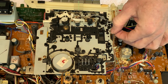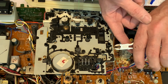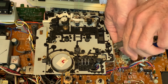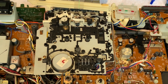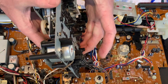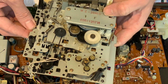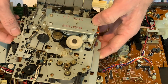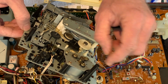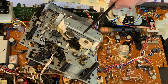We'll also get the retaining screw out - all this one does is retain the cables. We'll get some side cutters and carefully remove these. And there is the tape deck mechanism - easy as that, literally four or five screws once we've got the tuner string out of the way. The bad news is this one has shed its belt all over the place - there's a bit on that pulley, some around there, and there's going to be lots around the flywheel. This is going to be fun.